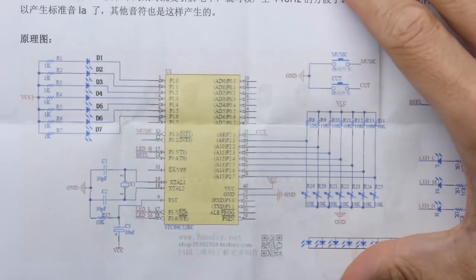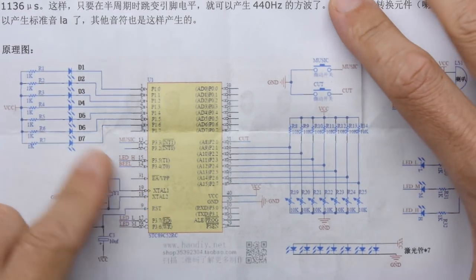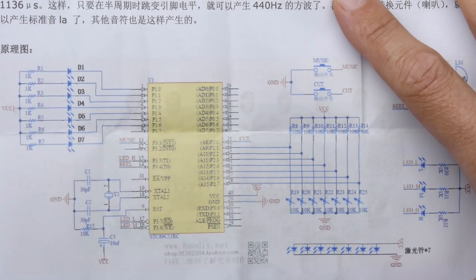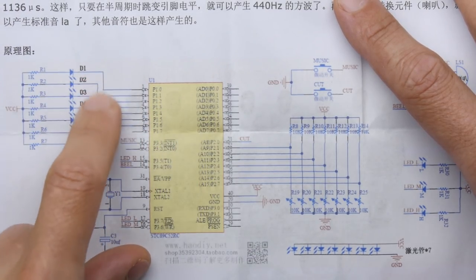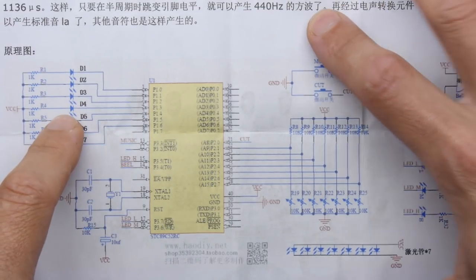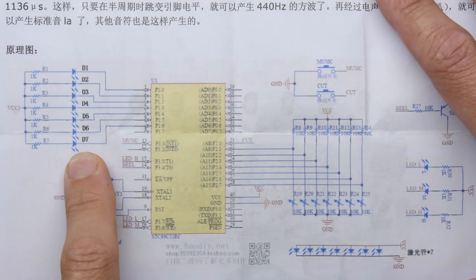See, it's pretty easy to work out here. You've got a bunch of lasers. No, these are just diodes here. They're LEDs, but interestingly enough, I don't know why they're doing it. They're coming from VCCs. They have power here, and they're being driven to ground through the micro itself. So curious why they're doing that. I don't know if there's any pattern going on with those, but there could be. At least it means the micro can actually control those if it wants to. I suspect they're going to be on all the time, but who knows? I could be wrong. In fact, I'm talking nonsense.